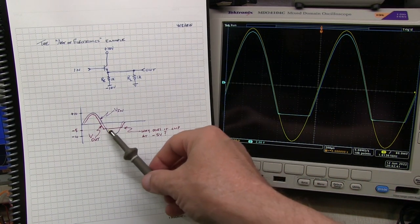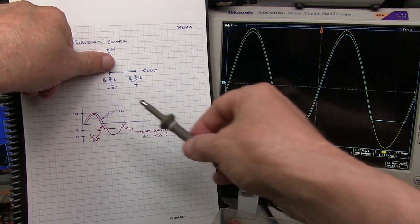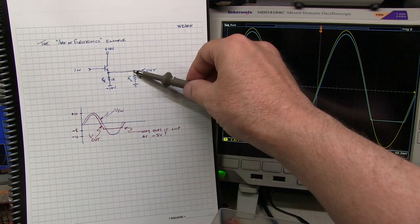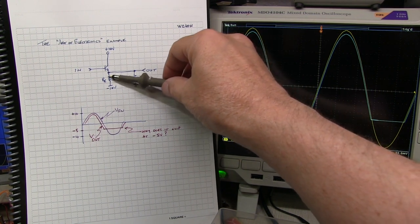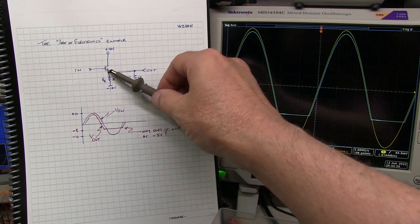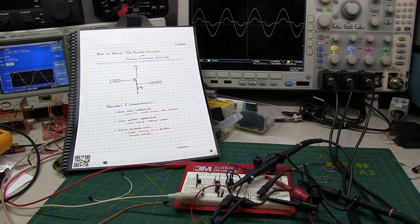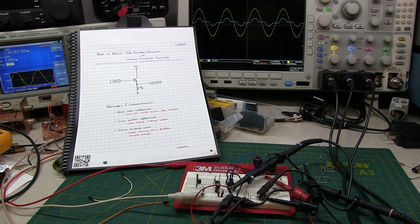With what you've learned today, you can see why the output clips at minus 5 volts. Even without the emitter-follower, the voltage at that node would be minus 5 volts — with minus 10 volts on one side and ground on the other, through two equal 1K resistors, the voltage is halfway between them at minus 5. For the output to go lower than minus 5, more current would need to be pulled through the load resistor — which would require the emitter-follower to sink current. An NPN transistor can't sink current into its emitter, so it shuts off, and that's what's happening. I hope this video helped give you a better understanding of the emitter-follower or common collector amplifier. If you liked the video, give me a thumbs up, please subscribe, and ring the bell for notifications. Thanks for watching!